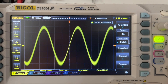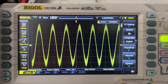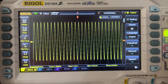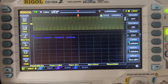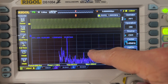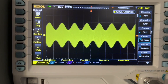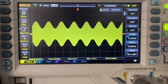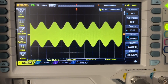You can see the nice sine wave. Let me kill the modulation here just for a minute. And you can see the harmonics are in good shape as well, right at 40 dBc. I've got the modulation drive level about 50% from my iPad, and you can drive this thing right up to 100% of course before clipping occurs.